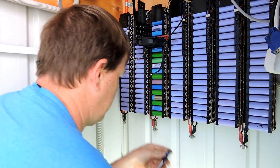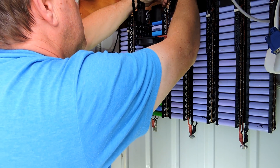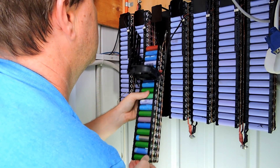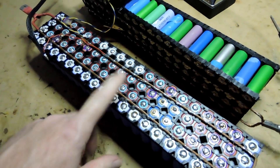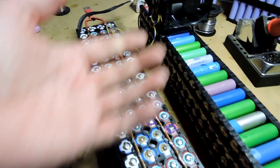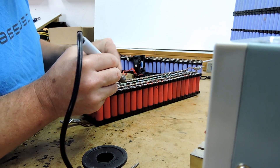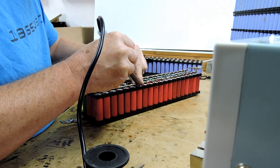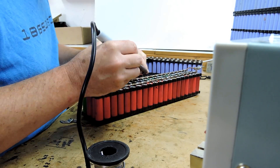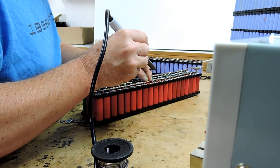Unplugging and pulling it out - probably only a minute to get it out, it's a good design even if I do say so myself. We're going to need a little bit of extra light. Let's go through - there's 54 cells. There's an awful lot of Sanyos in that pack, which might be why it was a little bit low, but it tested fine so it doesn't matter. Some solder, some fuse wire. It'll be interesting to see if any of these fuses blow as soon as I re-add them. There were actually two more that I hadn't marked that are broken, so I'm going to do a good visual inspection before I put it back down, making sure every single one is good.